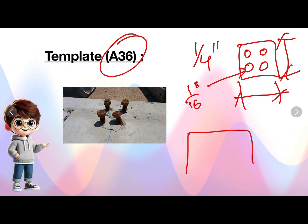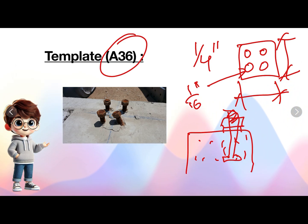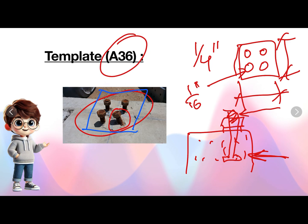When you cast concrete and insert the anchor bolts, right after inserting the anchor bolts, till the concrete gets hardened, if any external disturbances happen to the anchor bolt at site, there are high chances of the anchor bolt deviating from its original position. As you can see in this picture, this anchor bolt got deviated from its original position. To avoid these kinds of deviations during hardening of the concrete, we will provide a template — a plate placed over the anchors with holes so that anchors will not get deviated. That is the purpose of the template.